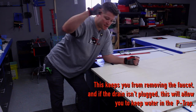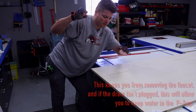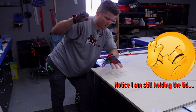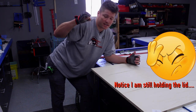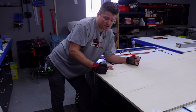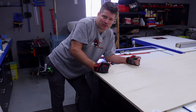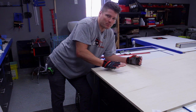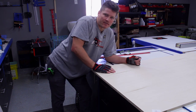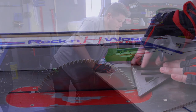So you would actually have to raise the lid to gain access to the faucet and turn it on. There'll be a faucet head that'll kind of go in like this, so I've got to have a huge cutout. It's about 14.5 inches. And then you would put the lid down after you're done. I'm going to use a table saw to cut these as straight as possible. I'll have to leave a little bit that I'll finish out with the jigsaw. But this is the cleanest way to get these straight cuts without having to use a circular saw and the chance of a bunch of veneer tear out.